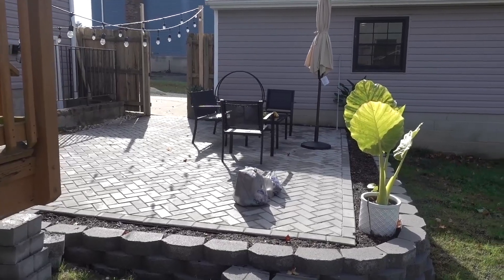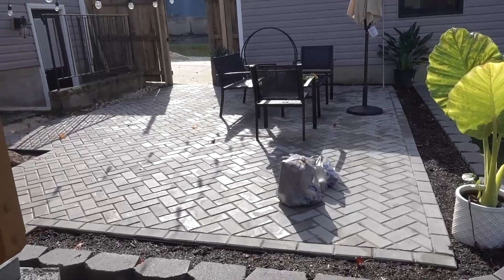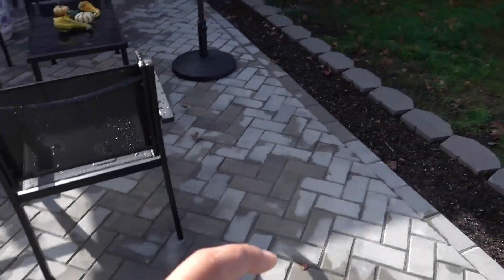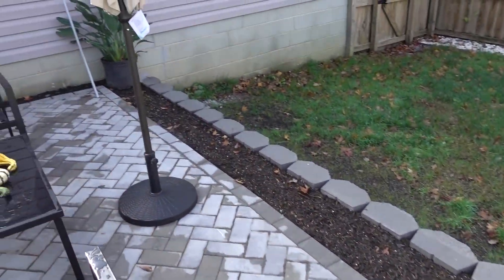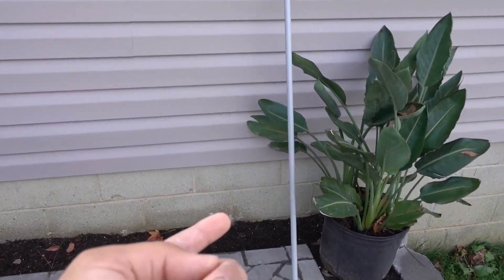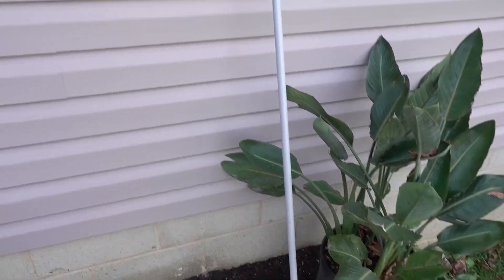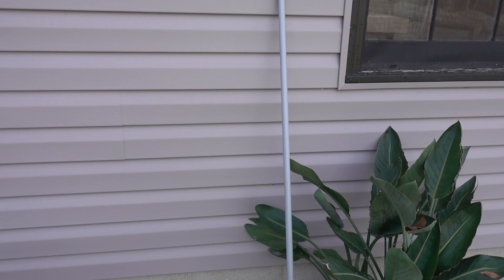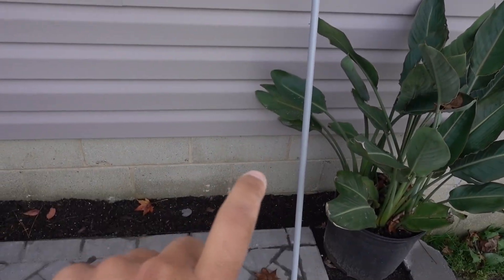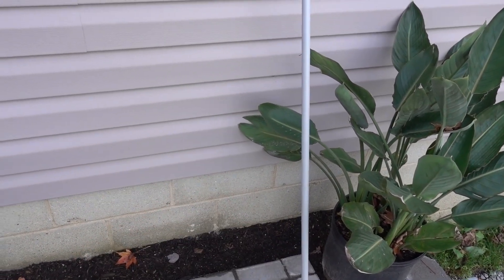It's been a really long time since my last video, but this is what I've been working on for the last month. It's about a 300 square foot paver patio with a herringbone pattern. My idea is to have some pathway lights along this garden bed that I added to the side, but before I do that I have to put an outlet over here so that I can plug the transformer that'll power the lights. To do that I'm going to tap into an outlet that's already on the other side of this wall, have that come out of this wall and go into a receptacle right there, and then just plug in the transformer.